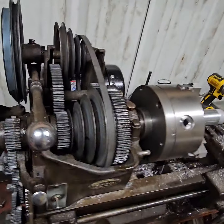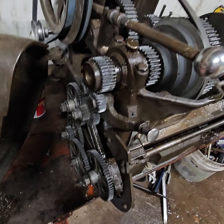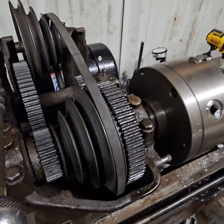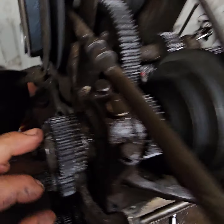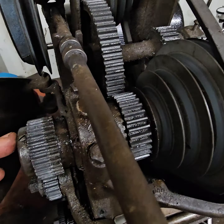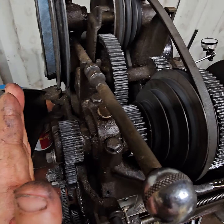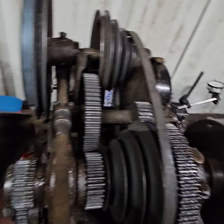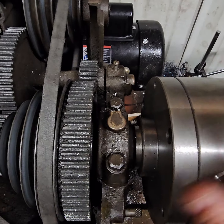So, you know, back when this thing was made, they made what they made. I'm sure bearings that tiny may not have existed, or maybe they felt it wasn't required, it wasn't needed. So the Timken bearing version of this lathe, this nut is adjustable. You pull this flathead screw, which you don't see anymore, it's set screws these days, and you adjust this and it pushes the cone bearing, like boat trailer bearings, the old wheel bearings, and you adjust the tension of the bearings till you get the 1/1000 or 1.5, whatever you want your readout to be.